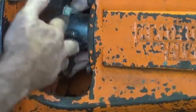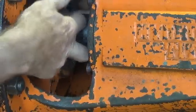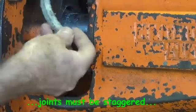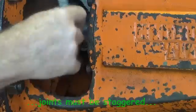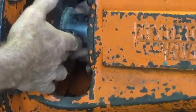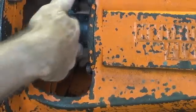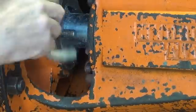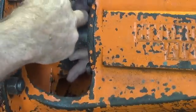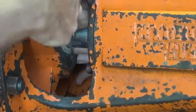When we put the rounds in we just have to make sure that they butt up nice and neatly on the ends, then push them down into the stuffing box. It's important that every round that goes in has the joint staggered — in this case I'm making the joint 180 degrees away from the first one. The next one I'll put on the top again so there is no clear path for water to track its way down and out through the stuffing box.